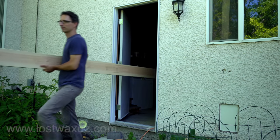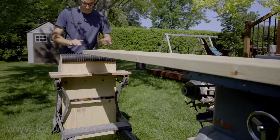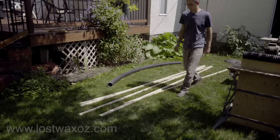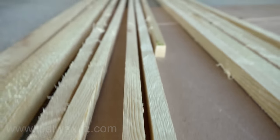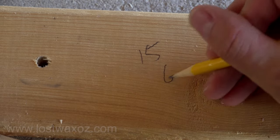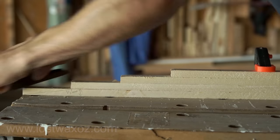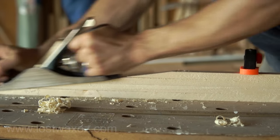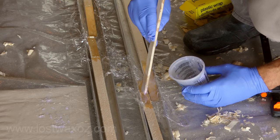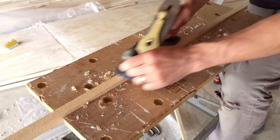While I was waiting for the epoxy to cure I decided to cut some big boards into smaller boards using my grandfather's not very awesome table saw. Note to self: gloves are better than slivers. These are long strips of wood, but I need to make them even longer to make my inwales and outwales on the canoe. I'm going to do a scarf joint, which in order to be strong enough needs the length of the joint to be six times the width of the piece of wood. I stack up four strips of wood and plane them down until they're all the same angle, then glue them together — first giving a coat of epoxy with no additives to soak into the end grain, then adding cotton fibers to make my glue paste. I wrapped some cling wrap around them and clamped them to a straight edge. Once the epoxy cured, I cleaned up the joint with my plane.